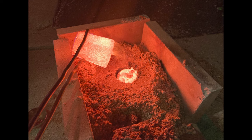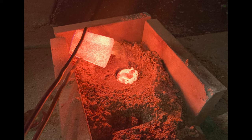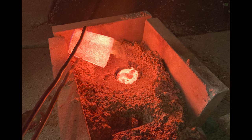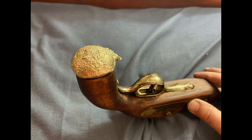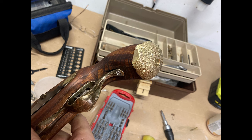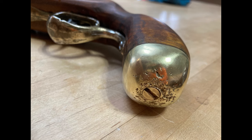This wasn't actually my first metal cast. In fact, my first one was just making a depression in some sand and pouring molten brass into it. That gave me a kind of lump shape, but it was good enough to fit to the end of my pirate flintlock pistol, drill a hole through it, put a brass screw in, and then start sanding and grinding and polishing until I actually had a pretty nice brass butt cap for my pirate pistol.